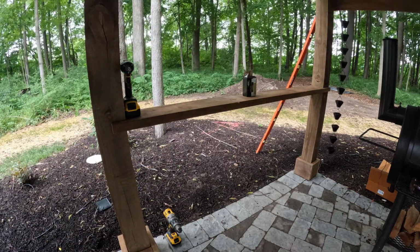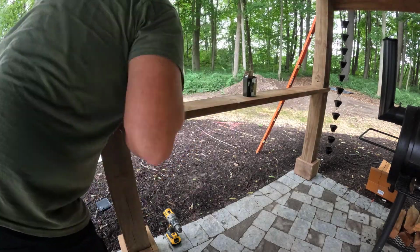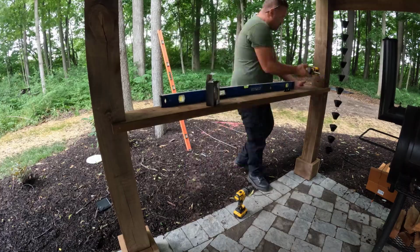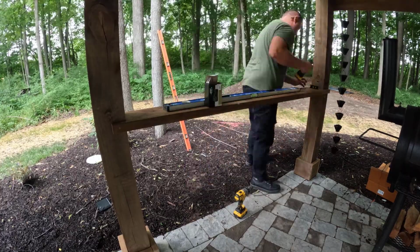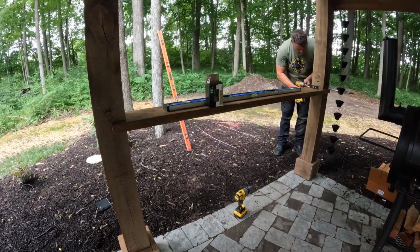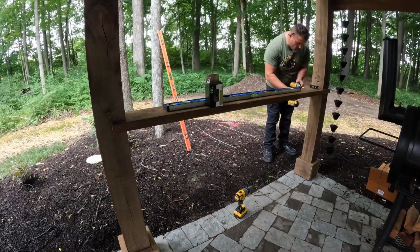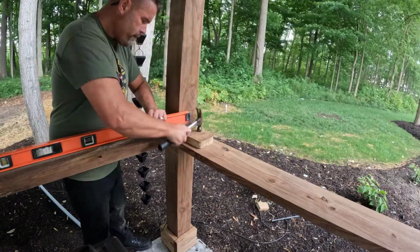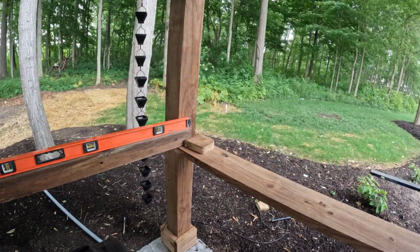These fit pretty snug. I think I went 40 inches high here. I think it said on Amazon or Google, I think it said 36 to 40 inches. So I went to the high end of that because I want to put as much firewood down below as possible. So I think I'm sitting right around 40 inches top on that. You can see why I put the notches in, because then I just drive screws on each side and it holds it up real nice.